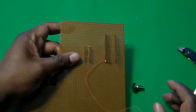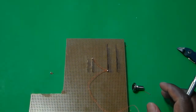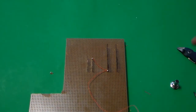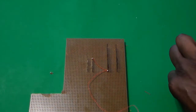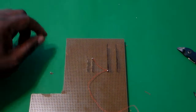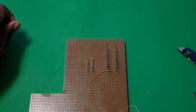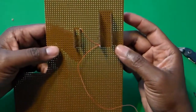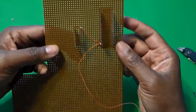That's in general how you would do wire wrapping. If you ever need to, you can use wire wrapping — it's a good way to do a somewhat permanent type of circuit build if you don't want to go to the expense of actually building a PC board and doing the etching and so forth. This is definitely a good alternative for that.